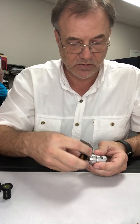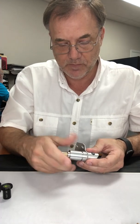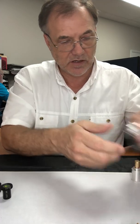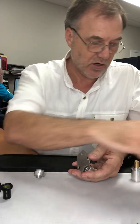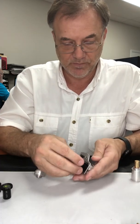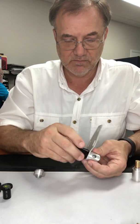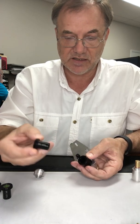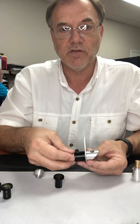This also works, and I have the alignment tool which goes for the standard K40 head when doing alignment of the K40 machine. The second part is the upgrade to give you adjustable focus, and with that you're going to want my adapter which just goes on to the head and gives you an adjustable focus lens. That's a 16 millimeter stem, so my 16 millimeter reverse alignment tool goes in there to give you the alignment of that head also.